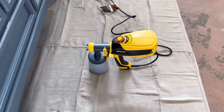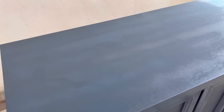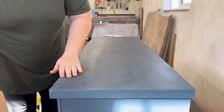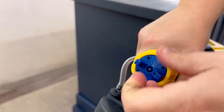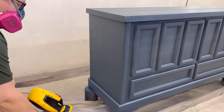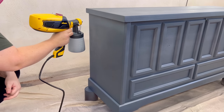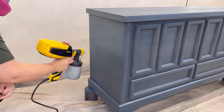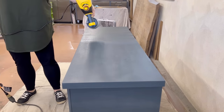This paint needs four to six hours of dry time in between coats, so I'm going to leave this for the afternoon. When it's time to come back and apply the second coat, I'll go over all the large surfaces with some 400-grit sandpaper super lightly, just to knock off any high spots or dusty bits that landed in my first coat. If you leave your sprayer loaded up, you'll get a little scab or paint booger over the tip — just pick that off and you're ready to go. You can leave your sprayer loaded up between coats, but I wouldn't recommend leaving it overnight. If it's going to be that long, I'd definitely take things apart and rinse out your gun. For me I did a quick test pull of the trigger on my drop cloth and it was good to go, so I applied coat number two the same way.